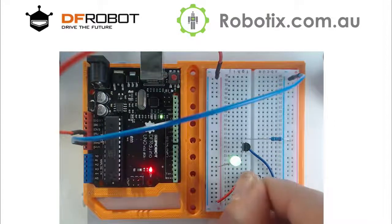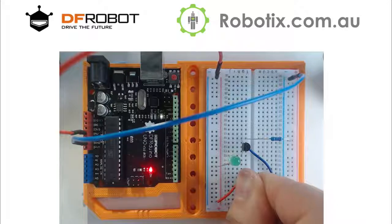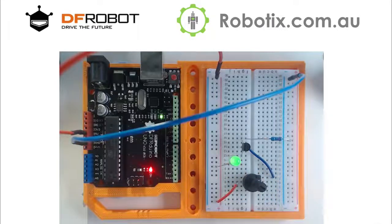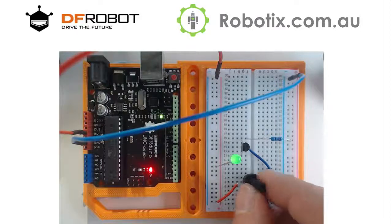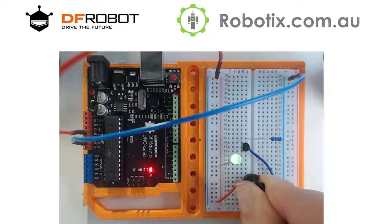So, in theory, we should be able to dim it, although it's going to have a very narrow transition area. Yeah, right there. Dimmed, bright, off, middle. There it is. So right now we have used a variable resistor to control the brightness of an LED through a transistor. And as you can see, the effects are much, much stronger. Even the slightest of turns has a big impact. That was very slight, and this also is barely there. And we go basically from 0 close to full brightness.